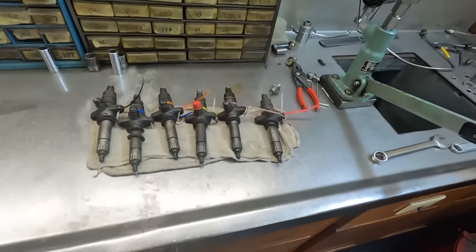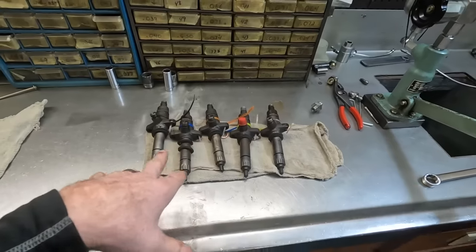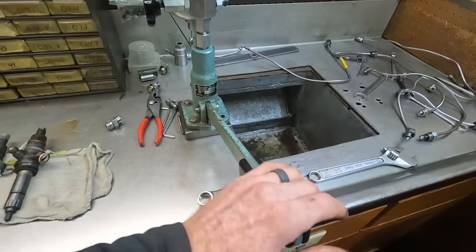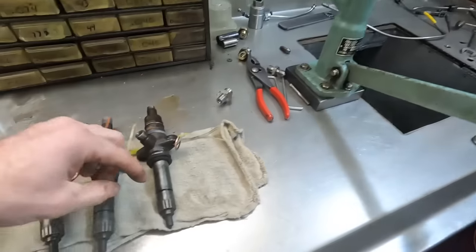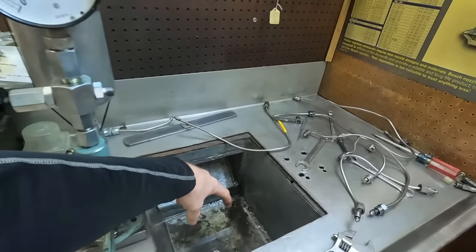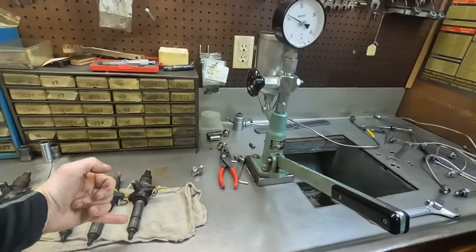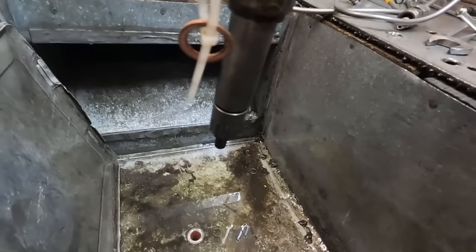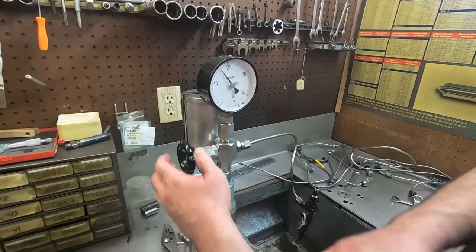All right, so now on that wheel loader, since we really don't know how the injectors are, while we're going through the pump still, we're going to pop test these. Like you've seen in previous videos, we hook it up to a line and they pump this arm here, and it puts pressurized diesel through the line, essentially the way the injection pump is going to do it on any diesel engine. It allows them to see the spray coming out of the tip of the injector, but also the pressure at which it's atomizing that fuel and dumping it into the cylinder. This is a four-hole tip down here. You can see the fuel is atomizing coming out. We got four holes that are good. We do have a leak up here, but we got a part on order for it.